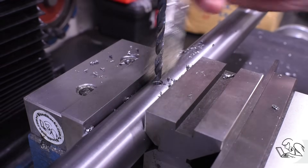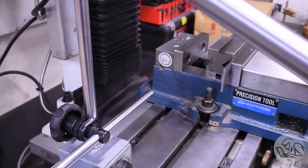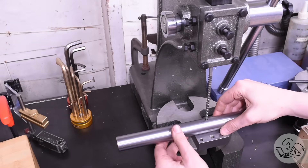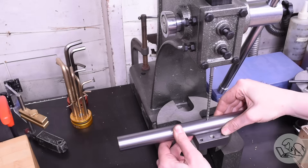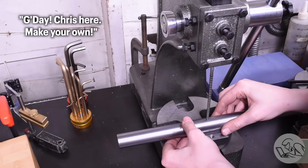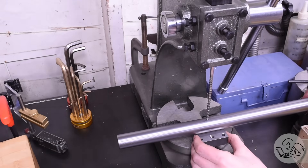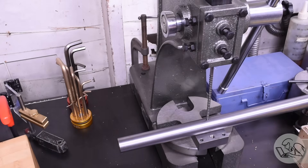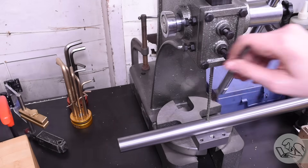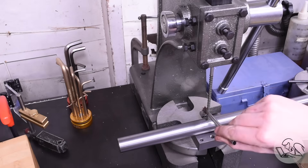There's the round cross hole — you can see how it's off-center, which messes with your head a little. Over to the press now to set up the broach. This is a 3/16-inch square broach from MSC Direct — not sponsored. These things are not cheap, so be prepared for sticker shock, but there are cheaper ways to do this which I'll talk about in a minute. Underneath the round bar I've got a cross-drilling fixture, a V-block with a hole in the center so the broach can pass through. The key is to make sure the broach is as vertical as possible — if you're pressing down and the broach is bending, you risk shattering it.